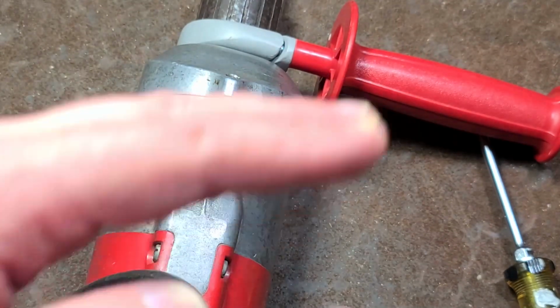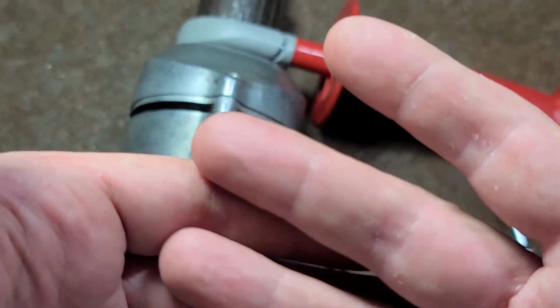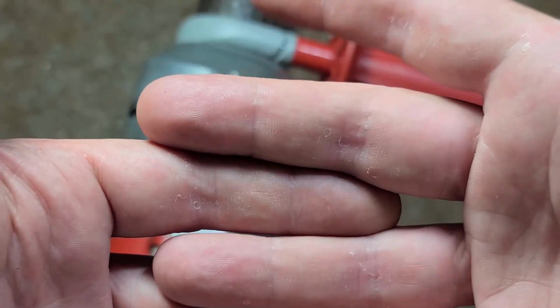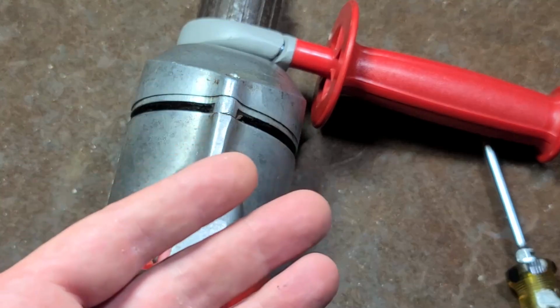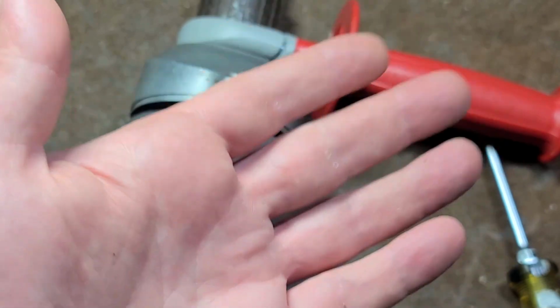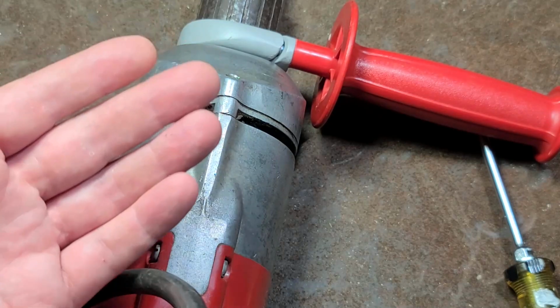Because with gears, whether they're helical cut, I should say that would be an angle helical cut, or a straight cut, you want them to interact and be absolutely parallel so the pressure is across the entire surface. And it's really been one of my big complaints about Makita drills. A lot of Makita tools, not all of them, but a lot, in particular their drills, don't include those alignment pegs. A lot of other manufacturers also don't.